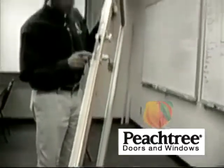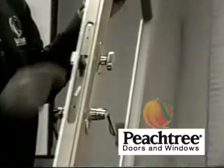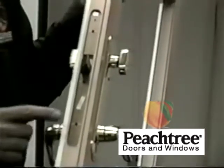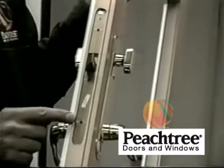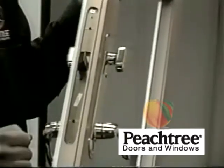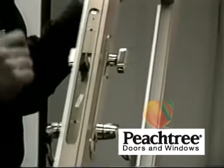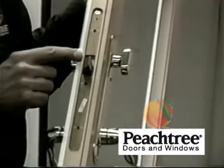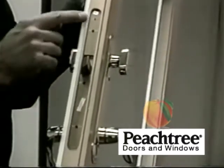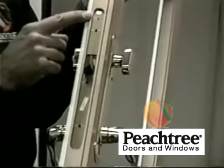The mortise lock, with the cover plate removed, you can see there's a wood screw at the top and the bottom of the mortise lock holding it to the panel. There's 3 threaded holes for the machine screws that hold the cover plate to the mortise lock. In addition to those, you have 2 slots or 2 holes, one above the bolt and one at the very top.